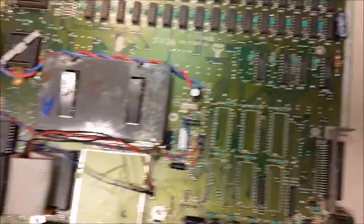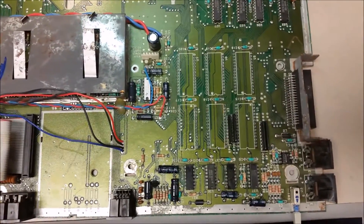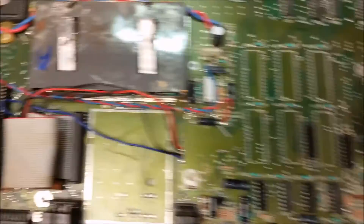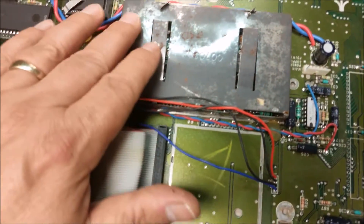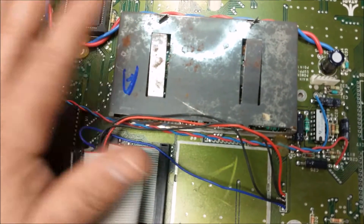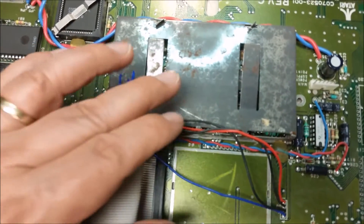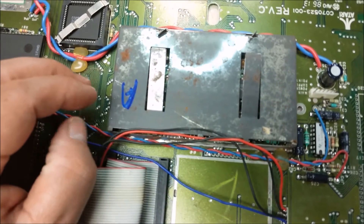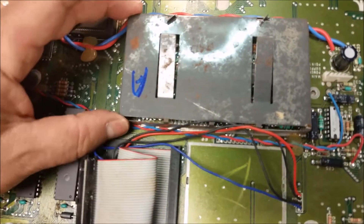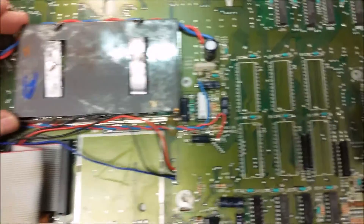The board's got the DIP sockets removed and it's got quite a bit more work to do — cleanup and everything. All this extra corrosion and material all over the board, we've got to get it cleaned up. We'll probably clean this up with a toothbrush and maybe some 2000 grit paper and some water, maybe a little bit of oil, buff it all out real good. Then we could paint it — depends on what my friend wants to do with it.